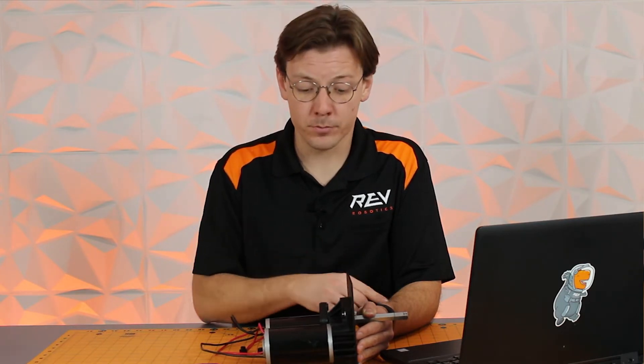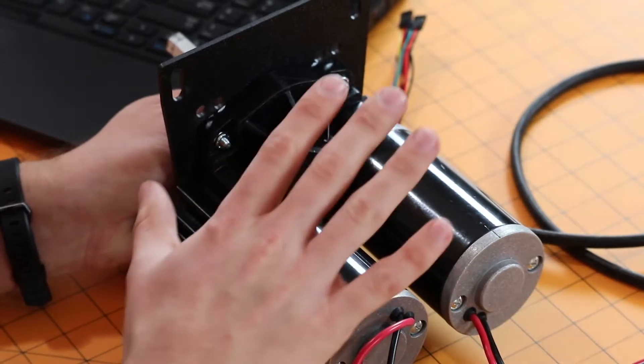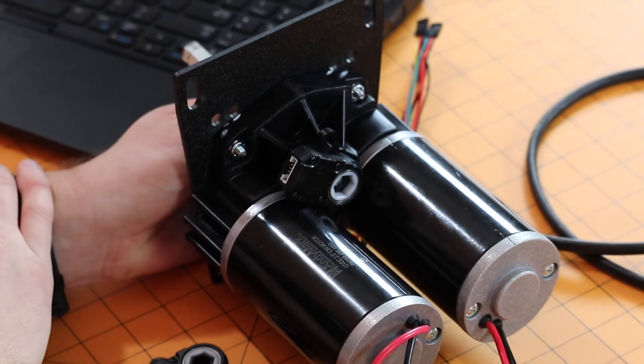There are a few ways you're able to mechanically attach your through-bore encoder to the gearbox. One is to take a small drill bit, drill a little pilot hole into the plastic, and tighten it with a small number 10 screw. Another easy way is through double-sided tape like VHB tape, or hot glue can work in a pinch. Once those are attached you just need to cable everything up either to your RoboRio or to your Spark MAX within the FRC system.